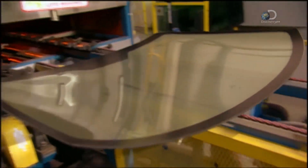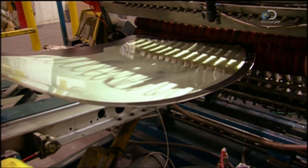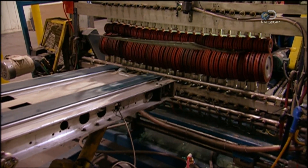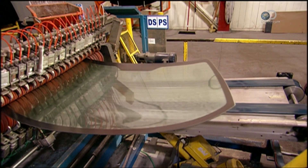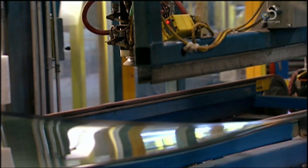At this point, there's no clear view through that milky white vinyl. That's why the windscreen is headed to a machine called a nipper. The nipper presses the windscreen between a series of rubber rollers, squeezing out air pockets in it. As the air is removed, the view through the vinyl becomes clearer.